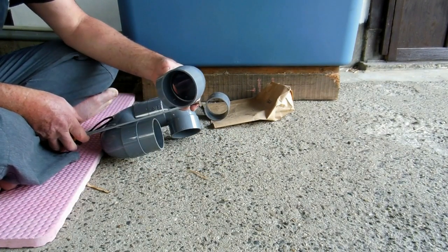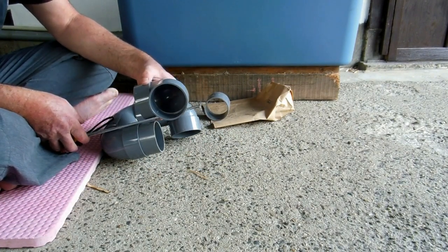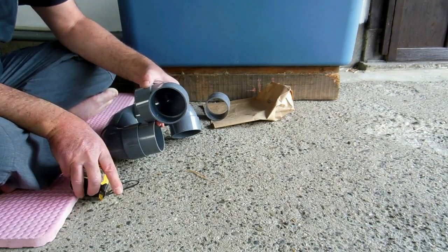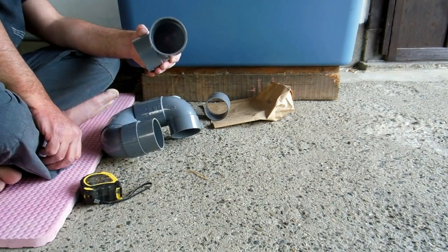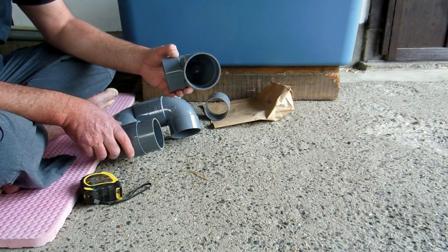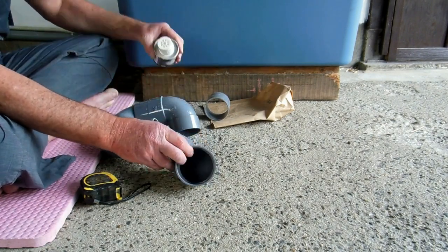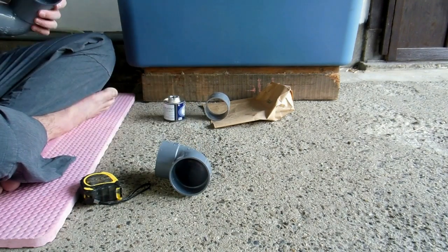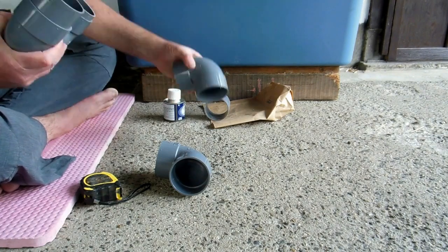And of course, the first part of the U, where it first comes out of the pipe, where the water first comes out, needs to be a little bit higher, doesn't it? So we've got to keep that drop happening as well, so the water doesn't start backing up the pipe. And we want it to flow. There's a lot of thinking going on here. And keep in mind too, this video's been sped up, so the actual contemplating was taking much longer than what you're seeing.